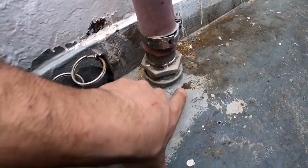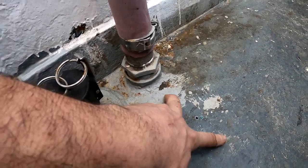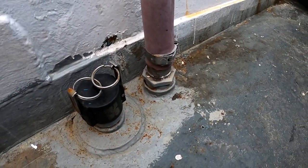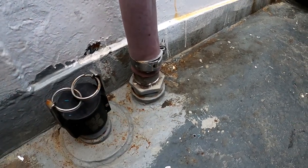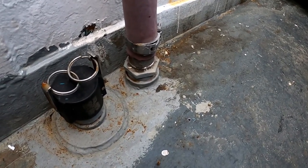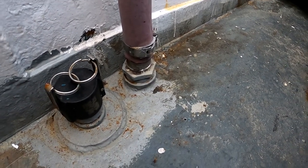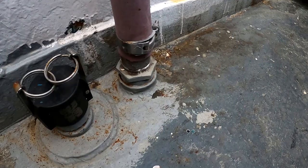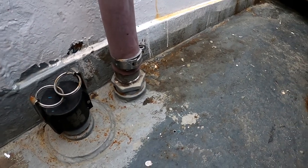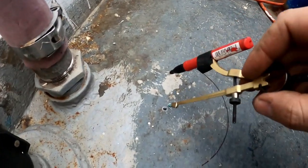It's going to be enough room to clear this pipe and weld a doubler plate. We'll probably have to trim the backside of the doubler, or the donut, but that's okay. Probably going to scribe a line and grind off the paint. I'm not sure about plasma cutting through that, and I'll get back to you. I might screw up, but I think I would have caught it.